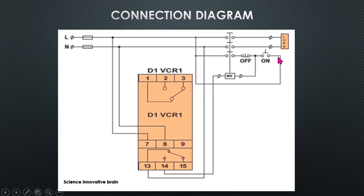The voltage comes from here, goes to the NO switch, then to the coil, and goes to pin 14 where there is a NO contact, and pin 13 goes to the neutral. So the first line will be sensed by this relay and the contactor will energize. This makes the contact NC, so when supply comes, the relay holds in this position.